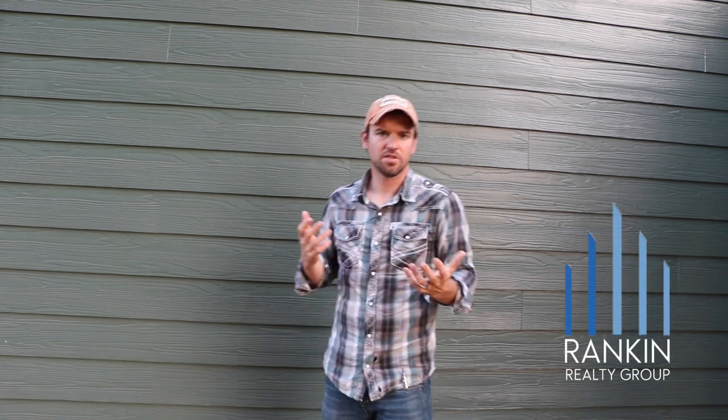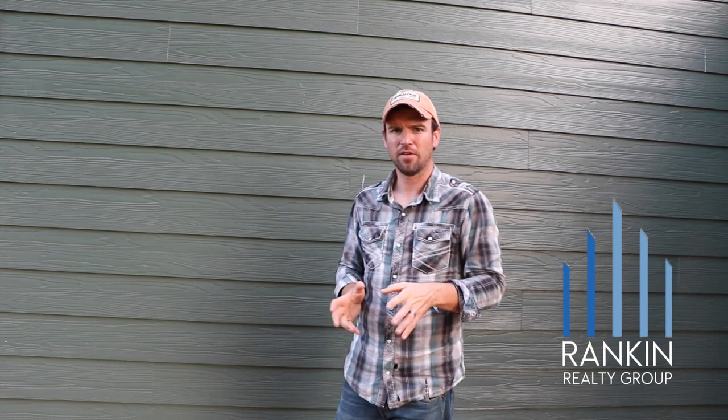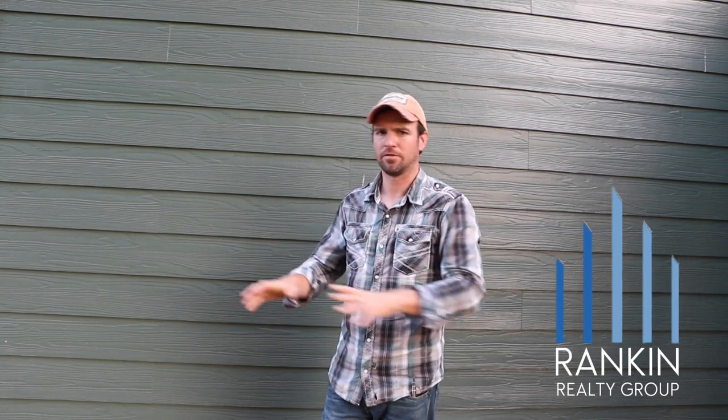So hopefully you learned something from this video. Hopefully I pointed some things out to you that you may not have known that you need to check for, but make sure that you see arc fault breakers in your panels. Make sure you see GFCI outlets throughout the house. We got those in, but I put those in. And make sure that your contractor has wired up your panels correctly, because if you can't make it past your panels, you're going to fail everywhere else.